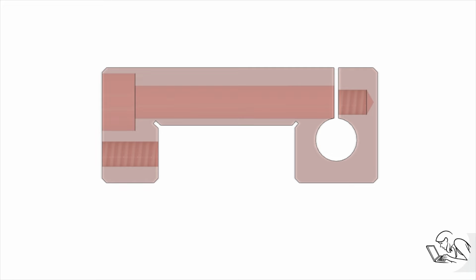This is going to be difficult. But Quinn, you said this was a beginner project. Well, if you want to do this easier, just drill this straight through and it'll be much, much simpler. I just wanted to have the nice clean front on the tool. Or you could have the clamping bolt come in from the front, which would probably make all of this a lot easier. But again, I wanted a clean look and I'm trying to stretch my skills here.